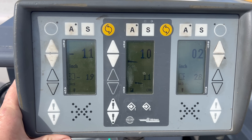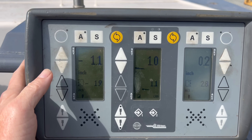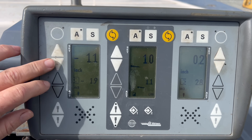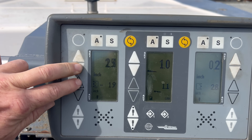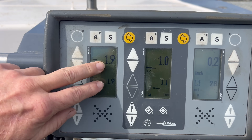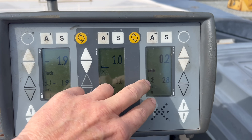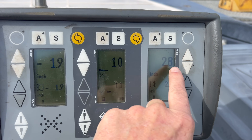Let's say you had your grade control off and you wanted to match the actual to the set. On the Fi's, you just push the button and it does it automatically for you. Well, there's a way to do it on this one too. If I wanted to match the bottom to the top, grab this button first, push it — don't worry about it running down, it's fine — then grab this one and it'll match. Do that with the automatic off, otherwise the machine's going to go crazy when you change the number.